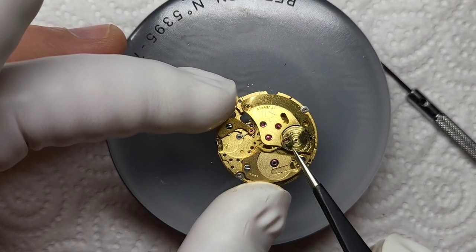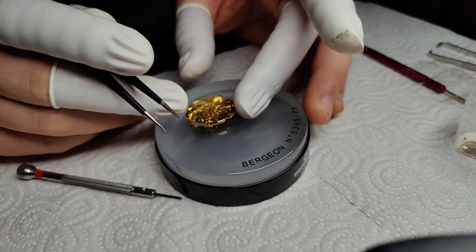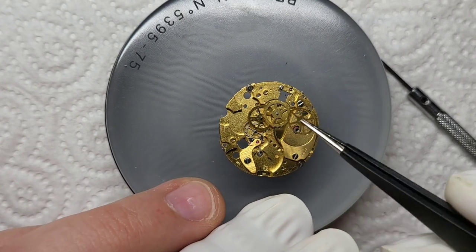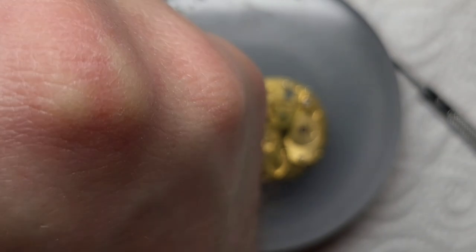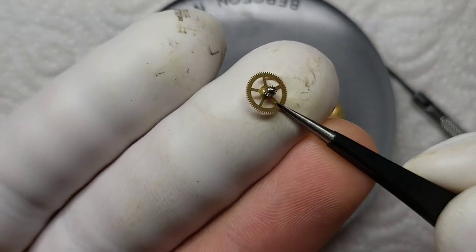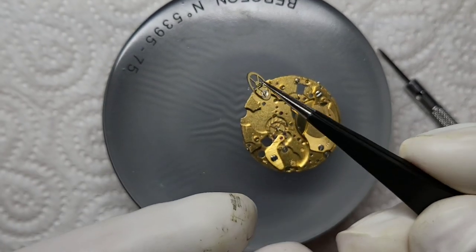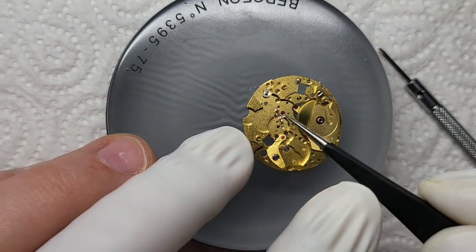There are lots of tiny mixing pots that I'm using — as I take off each level of the watch and everything underneath it, I'm keeping it all separate in these little pots, in an effort to help me put it back together. With the bridge off, we're onto the train wheels. This one is the minute wheel — that's the long thin stem which runs through the centre of the chassis and comes out which the minute hand sits onto. I do know this particular one is the escapement.